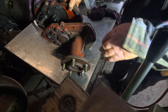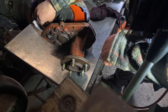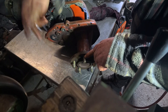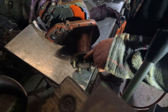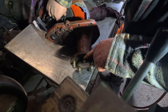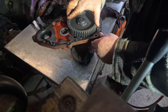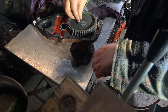So now we've taken that cover off. What we have here is the drive — there's a differential in here, and this shaft is the drive, which obviously comes out here. Then there's a gear wheel there, and it runs down through a series of reductions until it comes to the final reduction, which is here, onto the wheel flange.